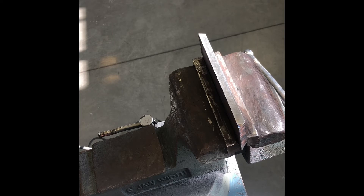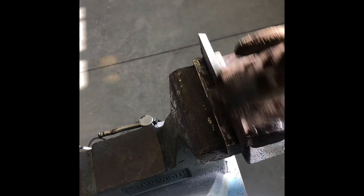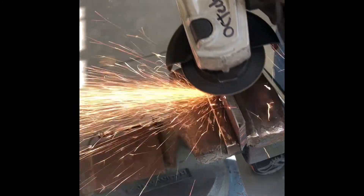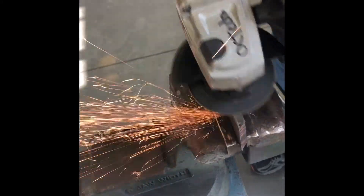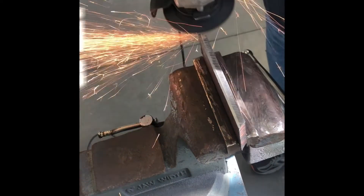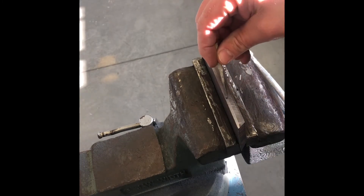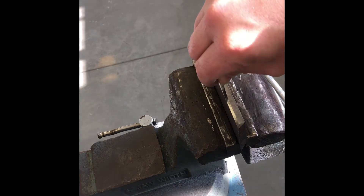Alright, so what I like to do when I'm putting on a landing - simple, easy straight pulls back with the grinder until I get the desired width that I want. Alright, I think that's my eighth, let me check it. I like it. That's how we're going to use the welding rod - eighth of an inch all the way down.